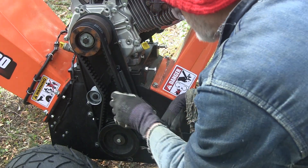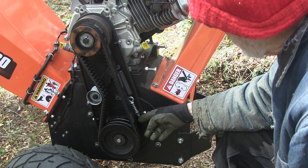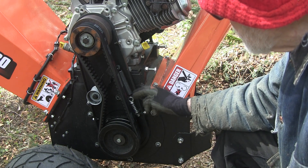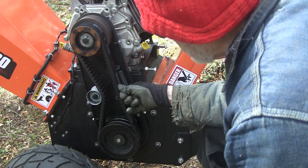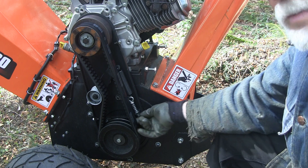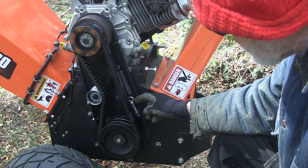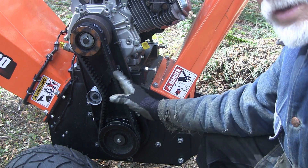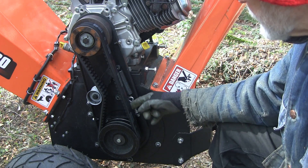There's still a lot of belt dust. The weeping on the seal isn't too bad. I'm going to tighten this nut up and leave it, knowing I have to change it or let the belts wear in more. They say three-eighths at 10 pounds tension — I need to figure that out. I'm really amazed at how much this thing vibrates. Those two little factory nuts would not have stood a chance staying on. If your chipper is bogging down or takes forever to get back up to speed after hitting something, your belts are dead and this thing is probably loose.